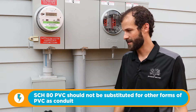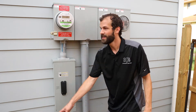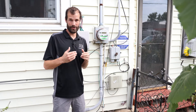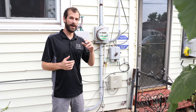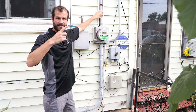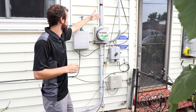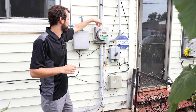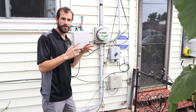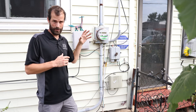There's energized wire on the other side of this pipe that needs to be well protected. The power then exits this 200-amp disconnect and goes underground to the house. Here we have another example of a residential electrical service. This one, as opposed to being underground, is overhead. So this is the service riser. The utility distribution system is overhead — it drops overhead to the house. The service riser brings power into the meter cabinet. You can see for a 100-amp service, which is what this is, the meter cabinet is much smaller. This is a single-gang, 100-amp overhead electrical service.